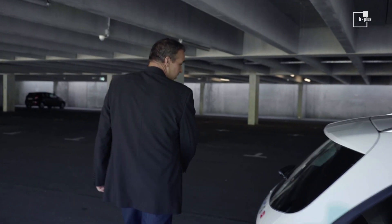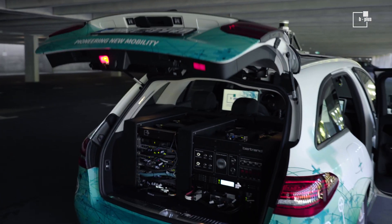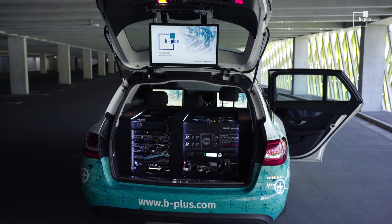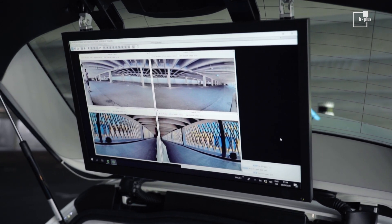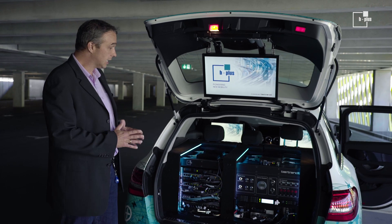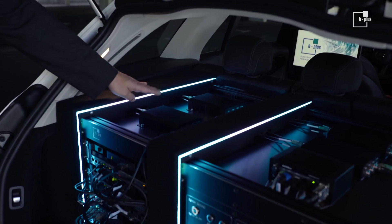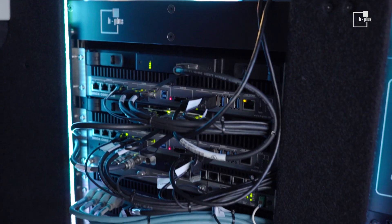Now let's have a look at the front. The main monitor shows everything we want to demonstrate with the whole system. Looking more closely, we have as components our so-called MDI-Link devices, which decouple the data stream from FPD-Link to Ethernet, feeding our measurement system.